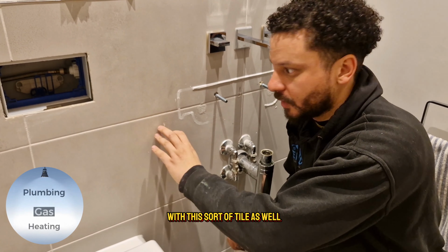And now all we're going to do is compress that in. Now I do have these by Ox, and it just stops you from eating this up with the grips, because the grips will really munch this up. So I don't like using the plastic ones. The plastic nuts get threaded. So if this gets threaded, I've got a metal one that I'll use instead.